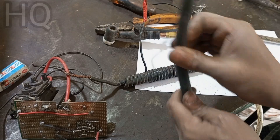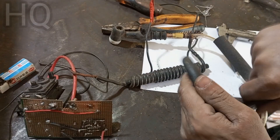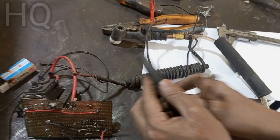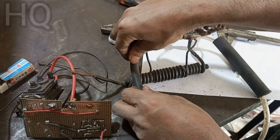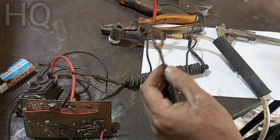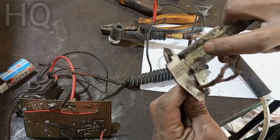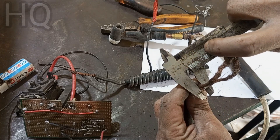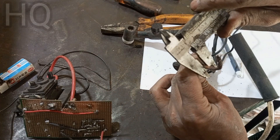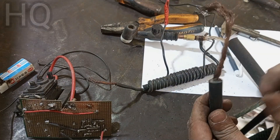I also have welding holder wire, but it is too thick and its cover is too heavy to fold. That's why I use the thinner wire as the secondary wire. Its copper diameter is also the same — 4mm — the difference is that this one is rubber insulated.